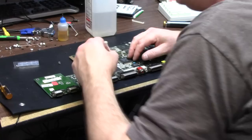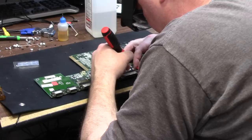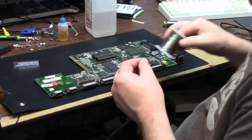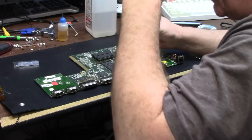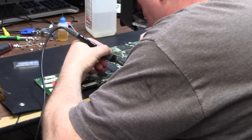That's a good thing. Now, I have no idea how I'm going to show you how to do this, but put your cap on there, position it with your poker, and push it towards the back to get as much of the negative closest to the back of the port as you can, and I'll show you why. Chip Quik SMD 2SW silver solder with my fine tip, cleaned. We're going in on an angle, solder on the one side. We're just gonna fill our cap up. Boom.